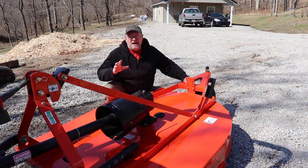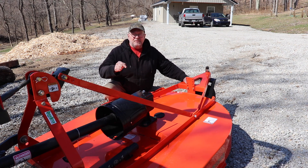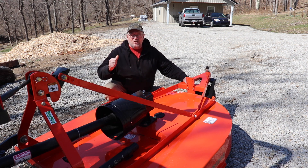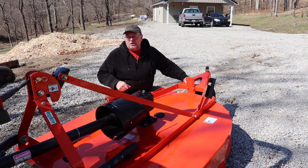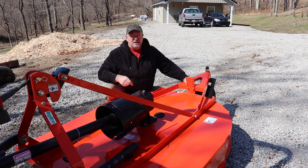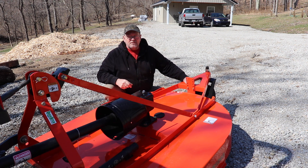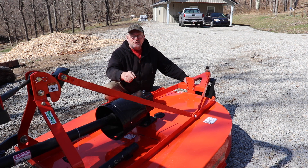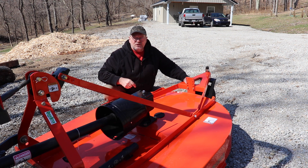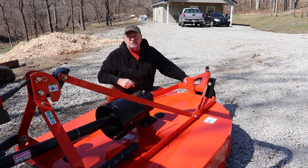I'm really happy to have another tool for the homestead and this one's going to be a doozy — it's going to help us out a lot. When that grass gets too high, we'll be able to brush hog it. Land Pride brush hogs are made to last for years if you take care of them. The gearbox has a three year warranty, so we know that's covered. Just make sure you've got fluid in it, keep checking the fluid, and grease any fittings you need to grease, and I guarantee it's going to last you for years.